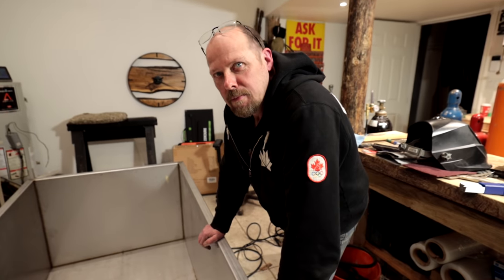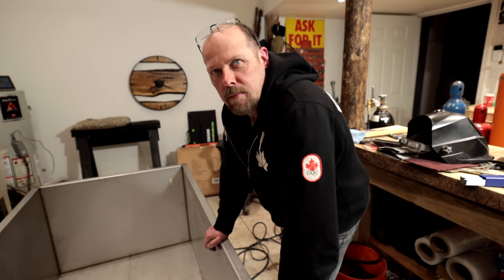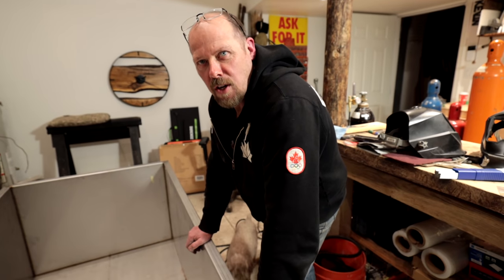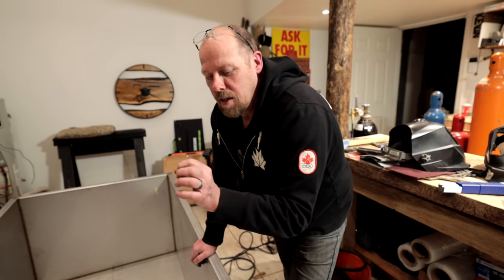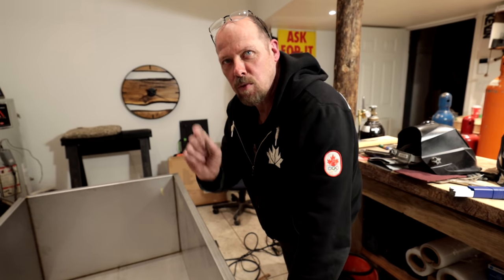So I took some video of the actual welding process. I've got the camera behind the lens. What exactly was I looking at? I could see the bright center and then the tip, and then there was a kind of little halo up the side. What exactly is going on? Well, what's going on is that I'm producing the arc through the tungsten. The power comes down through the tungsten, comes down to that little narrow point, and then it flares out, and that's what's producing the arc.